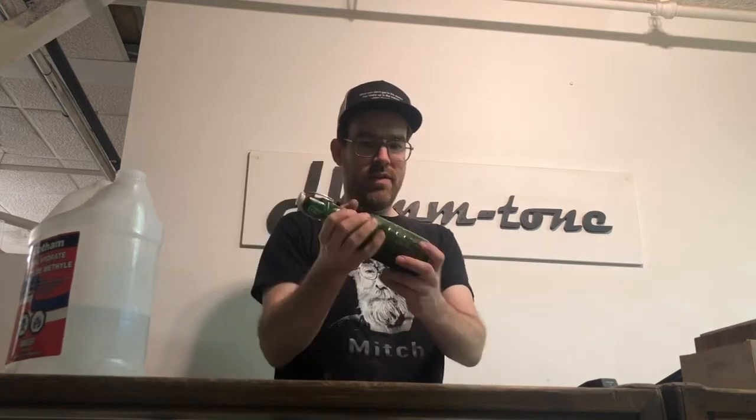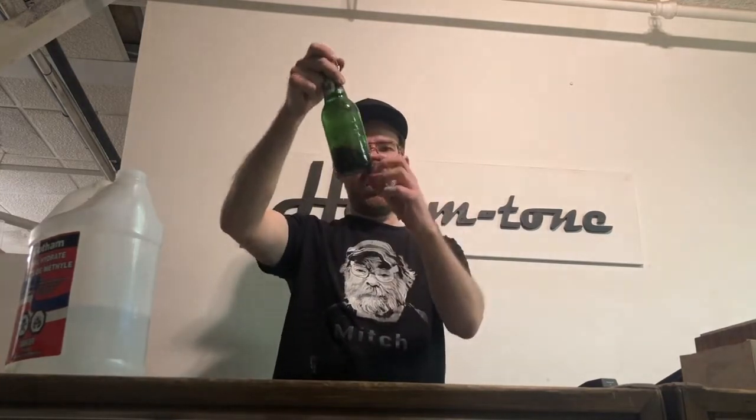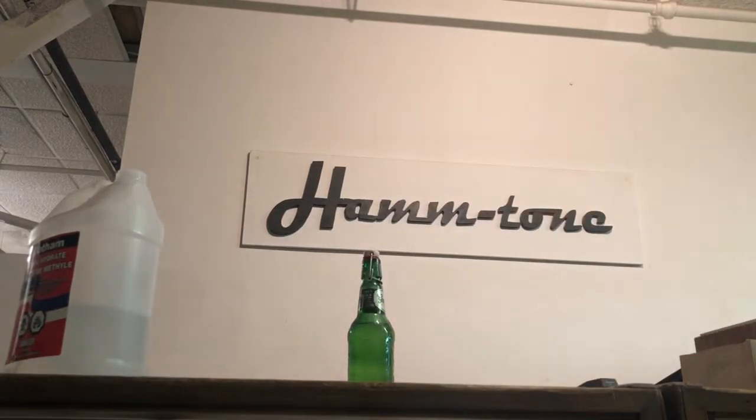I'm gonna shake it, and then I'll leave it on my bench. Every couple of hours I'll pick it up — if there are shellac flakes stuck to the bottom, I'll rotate it so those clumps are on top and they fall down. Gravity is our friend. Within 24 hours you should have a nice bottle of dissolved shellac flakes.